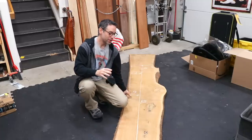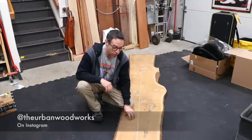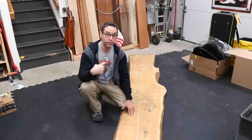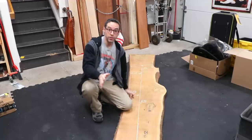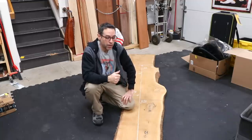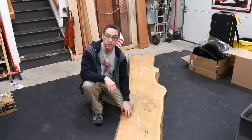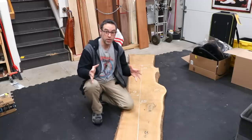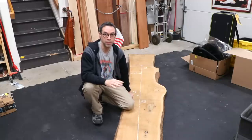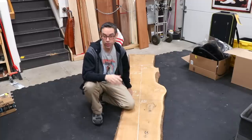I just received a gift from a gentleman named Chris — an air-dried slab of white oak. I still have my kiln-dried pieces soaking and I do plan to see how that affects the bend, but I think I'll push forward with the project using this air-dried stock. Some people say with air-dried wood you don't need to soak at all — just make sure you steam it sufficiently. Others say you should soak a bit to raise the moisture content, especially in a low-humidity place like Denver. I'm going to go with a good strong steaming and cut it up to see what happens.